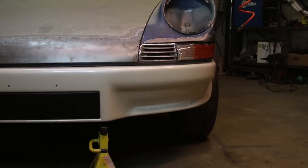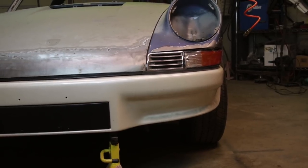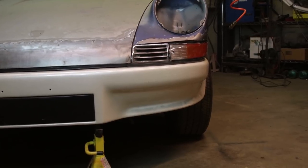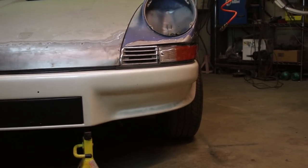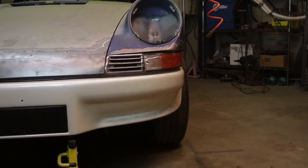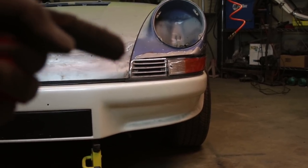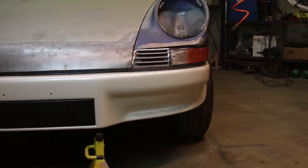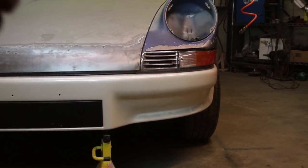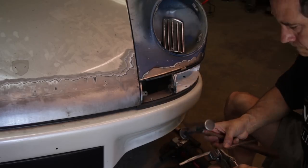Okay, all I've done here is I've just cut that corner where the turn signal box is attached to the fender. And it's really relaxed everything to allow things to fit horizontal. I mean, this is just how I want it. So now I'm dealing with the empty space there at the top where I cut it. I need to fill that up. And I'm also dealing with, I think you can see over here, this gap right here just got a little bit tighter, only because the grill is rotated horizontal again. So I'm probably gonna have to tune up this edge here on the side. I'm gonna have to tune that up a little bit as well to get the gap back.